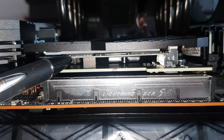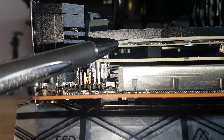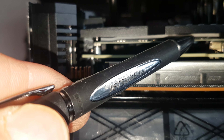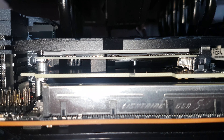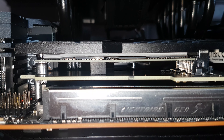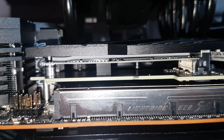Does that make sense, or am I imagining this? I think I have contact at this one location here, but the other three chips on the circuit board — I can see daylight through the Frozr heat sink, the thermal pad, and the actual SSD itself, which is 2.38 millimeters thick.